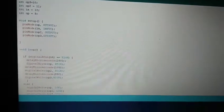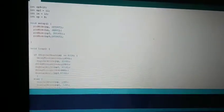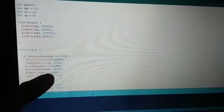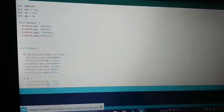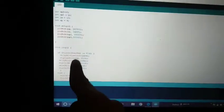Here is the code — just a simple if-else statement. For the first stage I had a certain microsecond delay, for the second stage and third stage I got the corresponding timing. This is the time pulse for the bullet to go from the first stage to the breach of the second stage, and so on. The else part is really important — without it all these pins would latch on to the high state.